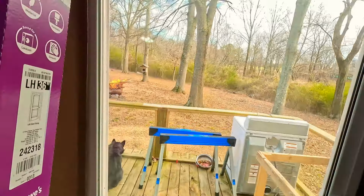I'm just going to put a 1/2 inch sheetrock on the ceiling. You're not going to notice a 1/2 inch difference in how you're standing. And that'll provide more fire barrier, insulation barrier, and sound barrier, and I ain't gotta mess with all that crap up there. It should be just about 1.5 pieces, because we are 6.5 foot by, like, 71 inch by 79 inch, something like that, right around in there.